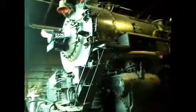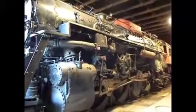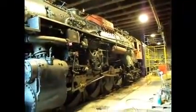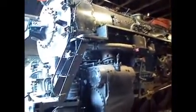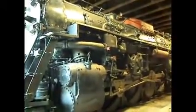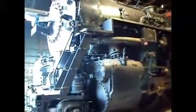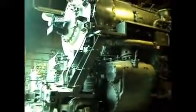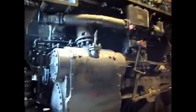It's going to be happening real soon, in the next coming weeks. Now that the water's in there, we're going to fill it back up once the leaks that we found have been repaired. Now that the cap is on there, we're going to pressurize it past the safety range of the boiler, to make sure that nothing else starts leaking again, and that way we know it's safe. And then once that's for sure, we're going to make the final repairs on the superheater tubes and shove them back in there. That's another reason why I'm not telling you when the steam test is, because then the volunteers who also watch this wouldn't show up to help us put those in there.